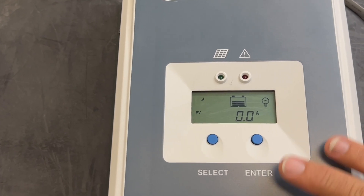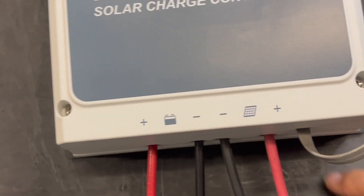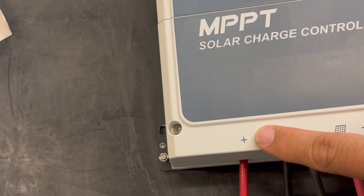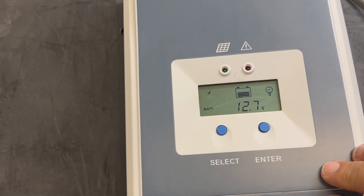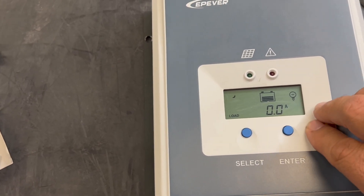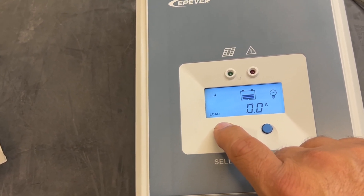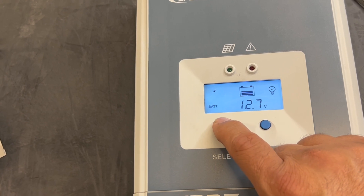As I said earlier, this is the unit we were testing — that cable on with the meter on. It's already hooked up here, as you can see, into the COM port. This is the larger model — the one that has a cover on it — so you'll need to take the cover off and then make the attachments here, just like you would the battery on the PV. This is the bigger model, the 60 amp model. The remote display makes it so much easier to read. Otherwise, you have to page through your rotating menus to find out where you want to go. You can still make those adjustments here, it's just a little more arduous.